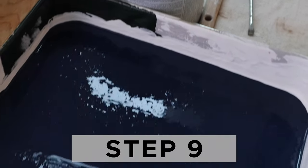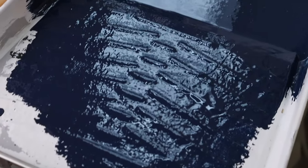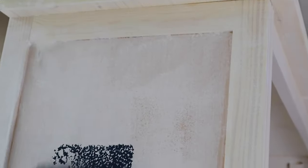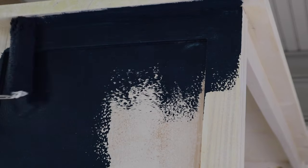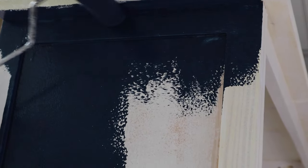The last step is to fill holes and paint or stain. Fill all nail holes with spackle if painting, or stainable wood filler if staining. You can also fill your pocket holes in as well if you prefer. If painting, prime the bookshelf and then add your paint. We used two coats of Anchors Away by Sherwin-Williams in eggshell — it's the same color we used in our DIY toy box and I love it.